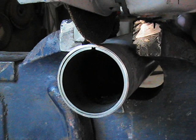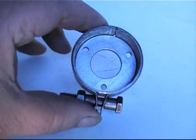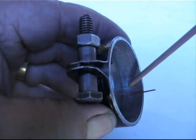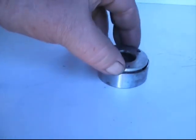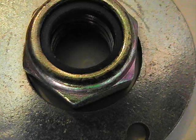Once you have squared the ring back to the line, leave it in place on the jig and carefully cut the ring through the seam. Now place the washer within the ring and squeeze it so it conforms to the circumference of the washer, then scribe a mark on the overlap and cut away the excess. File the cuts square so that they meet when clamped around the washer. If you find you have a slight gap, place a piece of wire or thin rod to take up the space — here I used a piece of MIG wire to fill the gap. It is important to make certain the gap is closed before you tack weld the join, otherwise it will contract when the weld cools, preventing the other washer from fitting inside the ring. Also check that the inside of the washer has sufficient clearance to rotate free of the axle nut; if not, you can knock the corners off the nylock to give the necessary clearance.